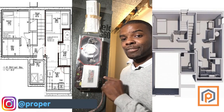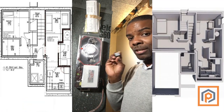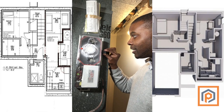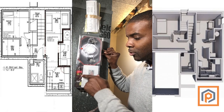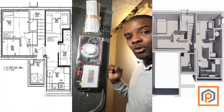I'm actually going to test this for you right now. In testing it, you need a magnet — it usually comes standard with a magnet for testing it. There is a little slotted area right on the side of it. You place the magnet and hold it. You saw that light switched — that means that it works. It actually just shut the furnace off.